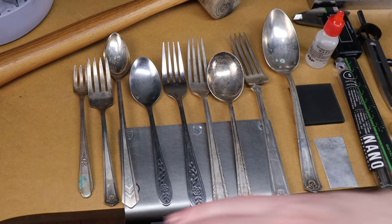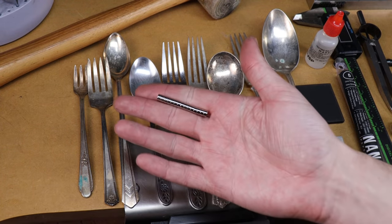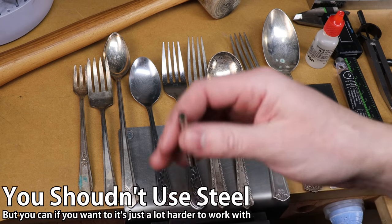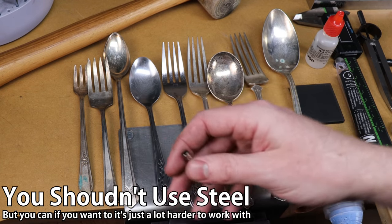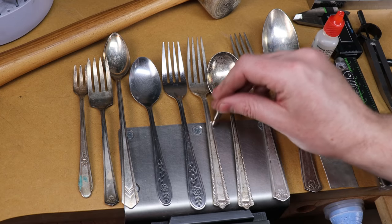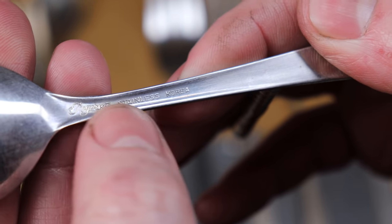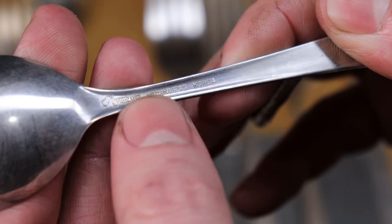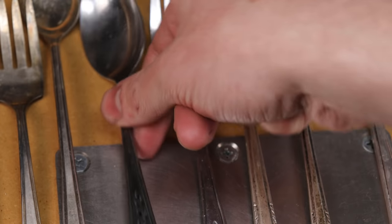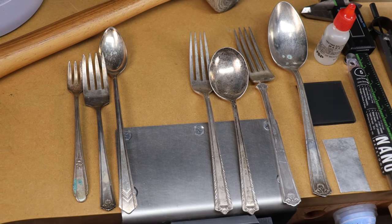One of the things is how do you pick your silverware? If you're going out and getting your silverware at thrift stores or anything like that, make sure you bring some magnets with you — some pretty strong ones. This will help you figure out if your silverware contains steel, which you cannot use. It is just too hard of a metal to bend into the right shape. Take your magnets and touch them to your pieces — it shouldn't stick. If it does, it means it's made out of steel. If you look on the back, it'll be labeled stainless steel. Some stuff will be stainless steel plated with silver and you can't use that either. Make sure to figure out which ones are actually steel and do not buy those, or remove them if you already did.